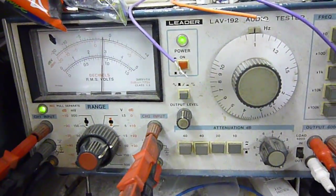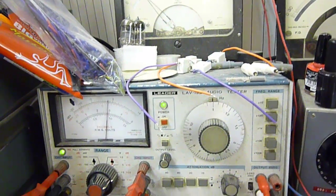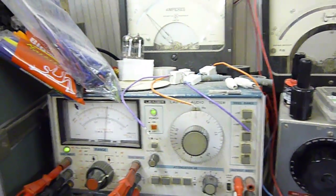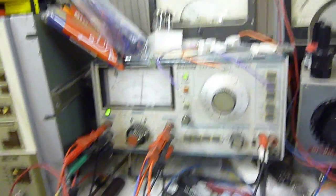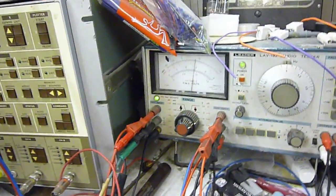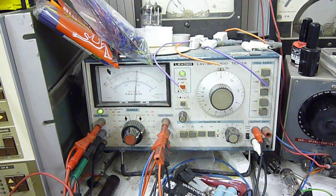We have about nine, nine and a half volts. We'll take a rough measurement for the time being. We know that power is equal to voltage squared divided by resistance. The voltage squared: 10 squared is 100. We know the resistance coming out of the amplifier is set at 8 ohms. So 8 into 100 gives 12.5. We backed off, so it's approximately 11.5 to 12 watts of power.